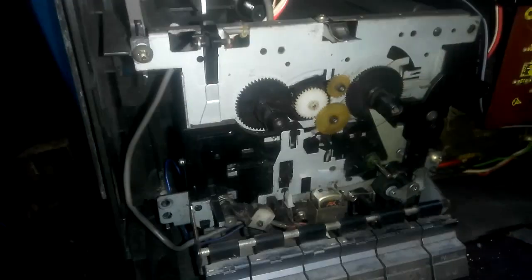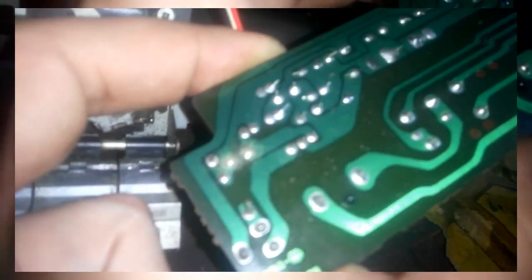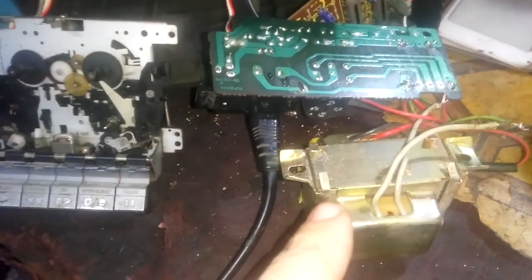We have another problem now — the power socket. I'm afraid we have a problem with the power board, so we'll have to take this part out again and check the power board. I'll re-solder everything as there might be a solder crack. Now it is working. But can you hear this buzzing sound? It is from the transformer — actually it's from the cover. I let the cover a little bit loose, and now the buzzing sound is gone.